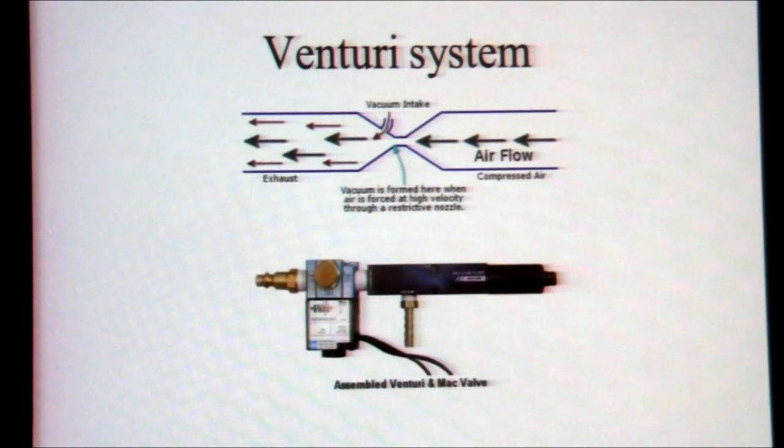I think he's asking how much pressure can you develop with how much vacuum? Well, pressure and flow, the same amount as with an electric. Yeah, once you draw it down to 28 to 30 inches of mercury, you've got your maximum pressure then. At what cubic feet per minute? It basically stops, once you have pulled that. As you're pulling it down, how fast or how much will it evacuate? It'll evacuate the air at 5.5 cubic feet a minute.